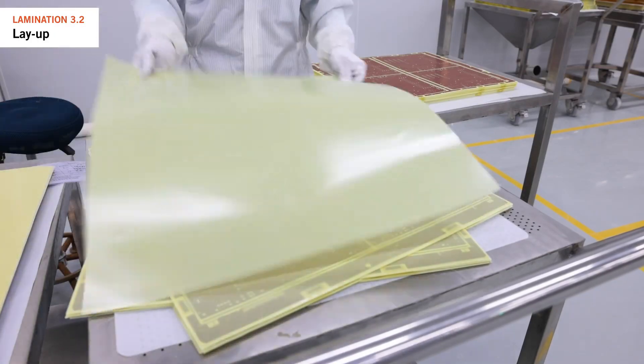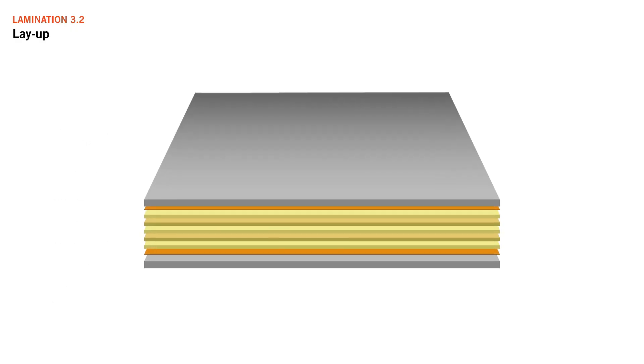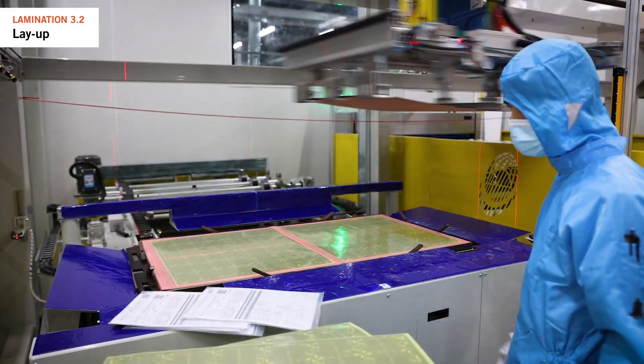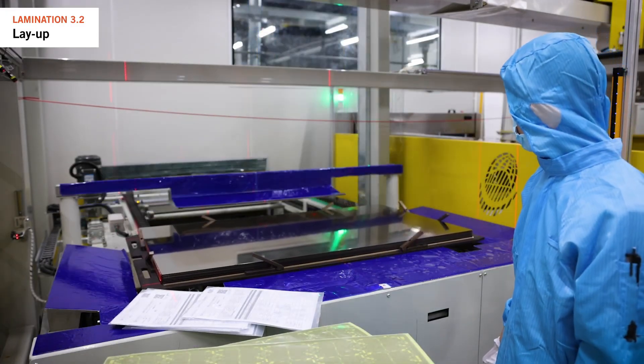Now, they're great for small to medium applications. But the problem is when you're getting larger, you cannot supply as many amps as compared to a larger axial flux machine. This is the design challenge — a PCB motor is not totally scalable from something really miniature to something very large, into a couple hundred horsepower or kilowatts. PCBs will also require high-temperature laminates, and there could be multiple laminations stacked together to handle higher currents, which limits power density and scale.